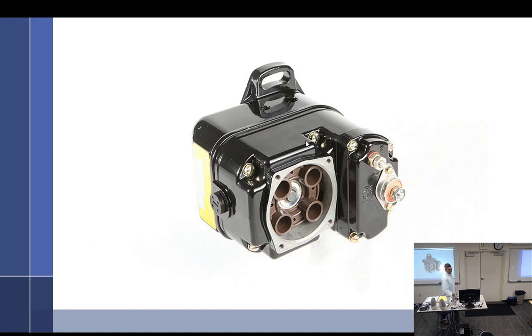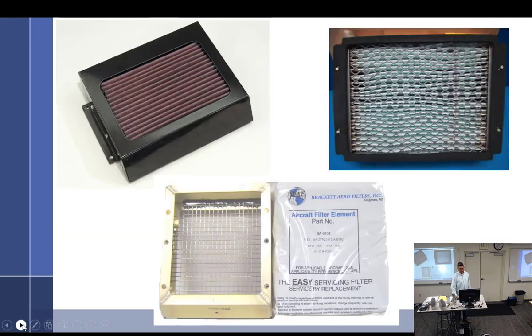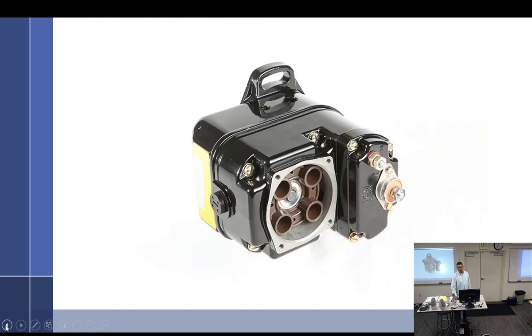So if you got one of these, you need two. But if you have the dual mag, you just need one. Let's see. I don't think I put a picture of it. So, when in doubt, specify. Do you mean an engine with two mags or an engine with one mag? There's nothing wrong with that. Because the dual mag, the one that runs them both, is called a D3000. D being dual. Want to see a picture? Want to see an actual one? Just the one shot.